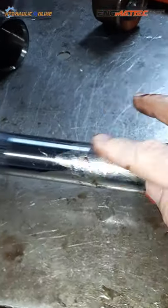If you don't have a lathe at home and you have access to a drill, this is what I suggest: getting one of these from Bunnings. They have a set. Well, your audience is North American, so Walmart or Home Depot. Get yourself a series of these in different sizes, and then you put these into the drill. They're quite inexpensive, but these are a high tensile steel wire, so they can be quite aggressive. You need to be careful what you're doing with these and not continue to polish for long periods of time.